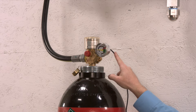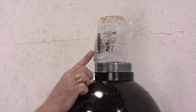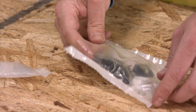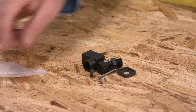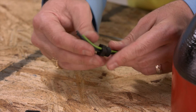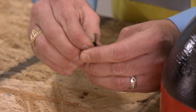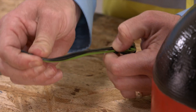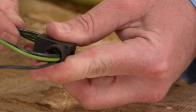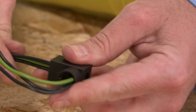Run the wire leaving the gauge to an FTCIO or XTRIS module. Now it's time to assemble the solenoid actuator plug. Locate the packet you set aside earlier and remove the components. Bring in the connection cable. First, slide the threaded knob onto the wire, knob side first. Next, slide the rubber gasket onto the wire toward the threaded knob. Then slide on the washer. Now you can slide on the socket housing — the wires should go in through the round hole and out the square.